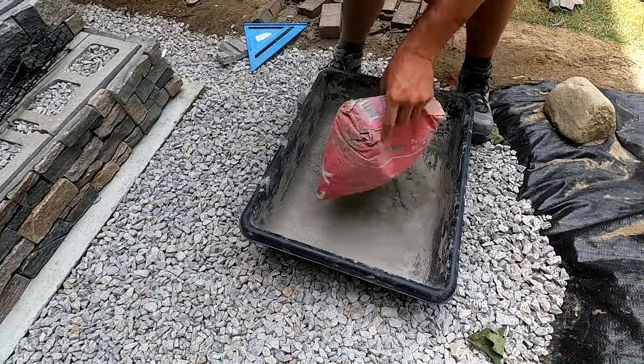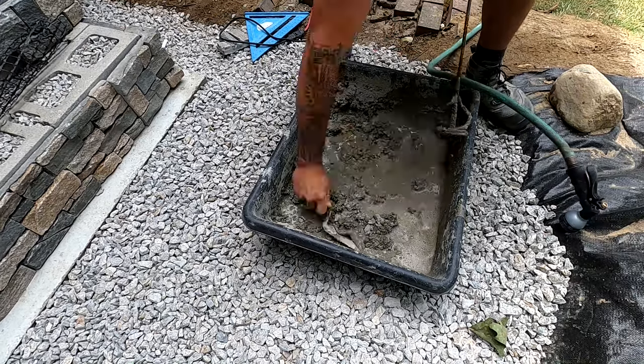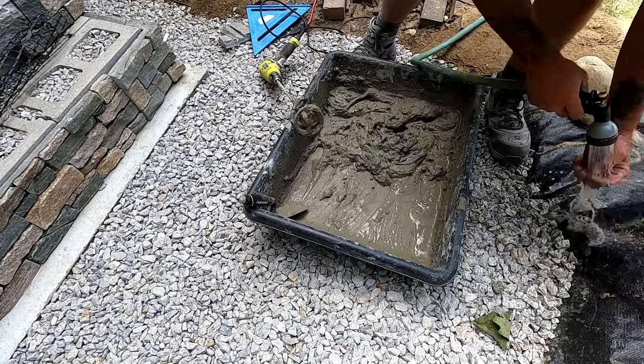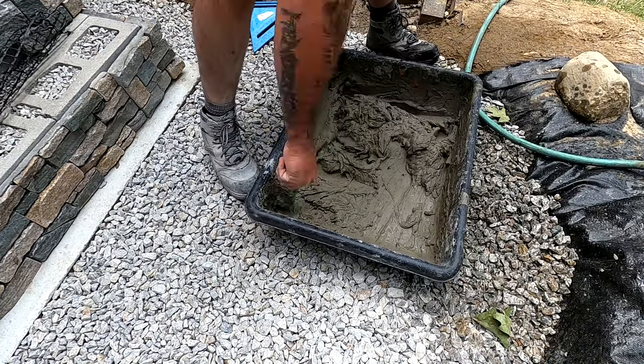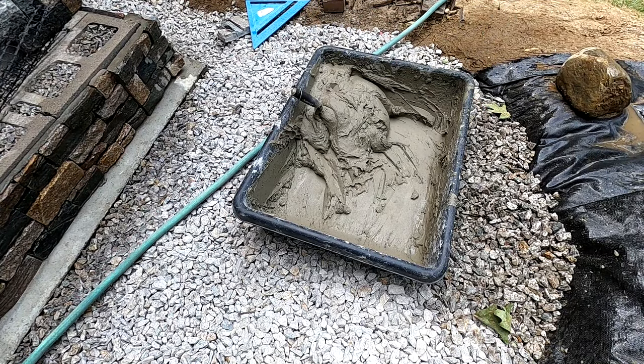If you're doing this and you can't find that particular brand, just look for something comparable — microfiber reinforced tile mortar, tile and stone mortar. It's very specialized, and it makes it very sticky and holds the bond way better than any regular type S mortar. You want to mix this stuff with an electric paddle mixer on a drill. You want a good consistency — if you make it too dry, it's going to set up on you real quick and be hard to use. Typically I use a five-gallon bucket to mix in, but you can mix by hand if you absolutely have to.